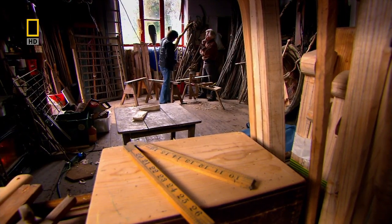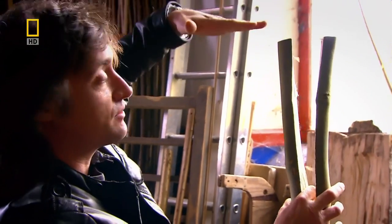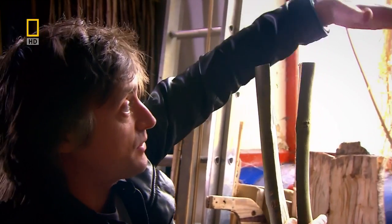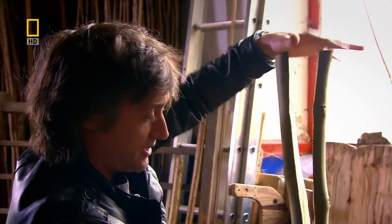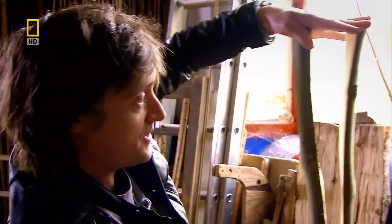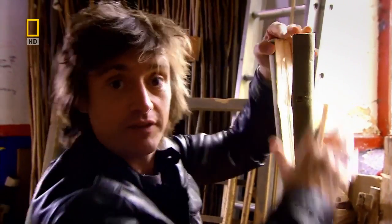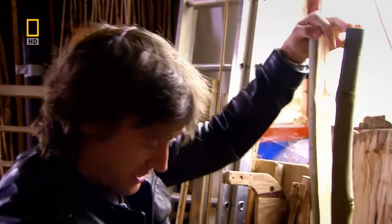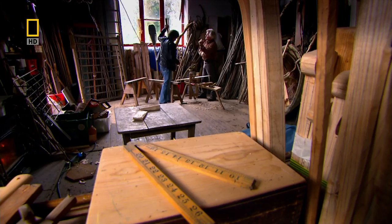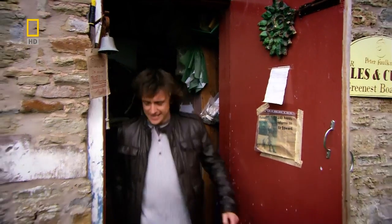Imagine this is one of the pillars supporting our bridge. The problem is flexibility — the road deck is so long that when it gets hot, it expands and moves out, or shrinks back when it gets colder. That needs flexibility, or it'll just snap the pillar. With splits in it, it will bend as much as you like, but because we've left the same amount of wood in it, it's still just as strong at holding things up — there's as much material working under compression.